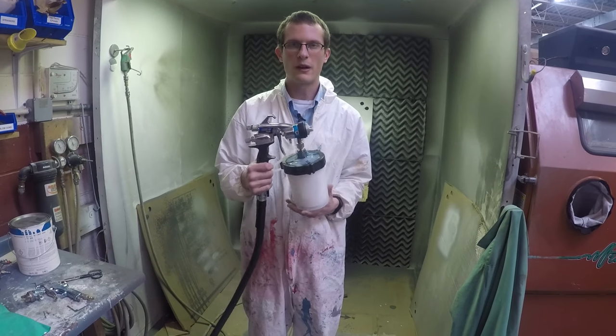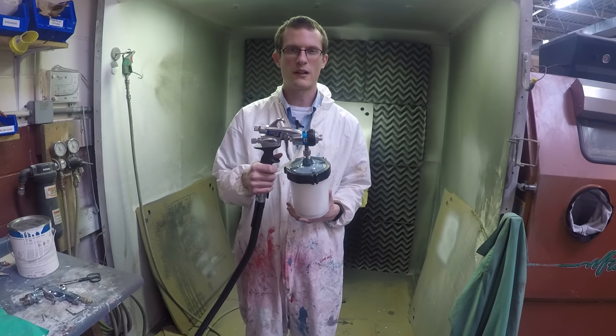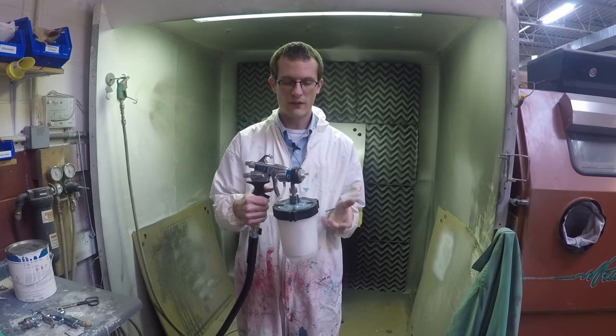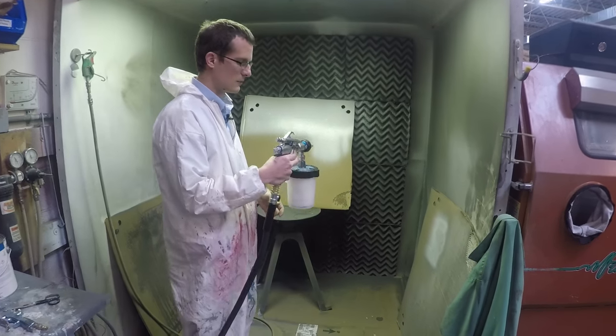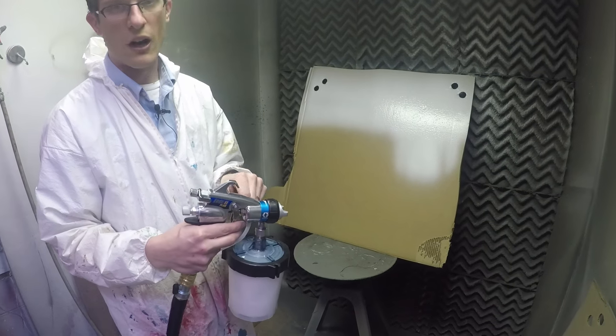The results, as long as you're spraying light to medium paint, will work just the same with this as with the air spray gun. We'll show you this — it's about a medium viscosity latex so you can get an idea of how the turbine would work. And then we'll show you an air spray gun so you can consider that as well. This is about latex consistency. You'll notice you hear the unit running.